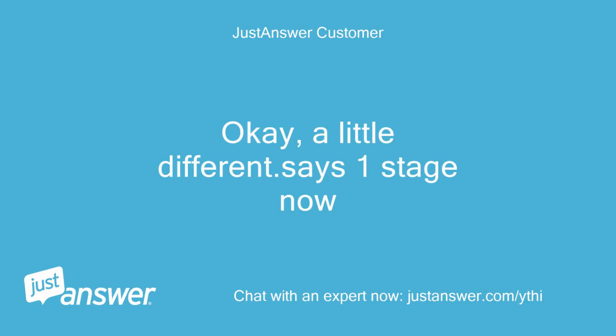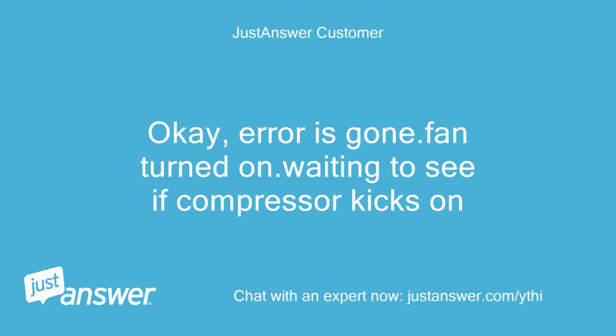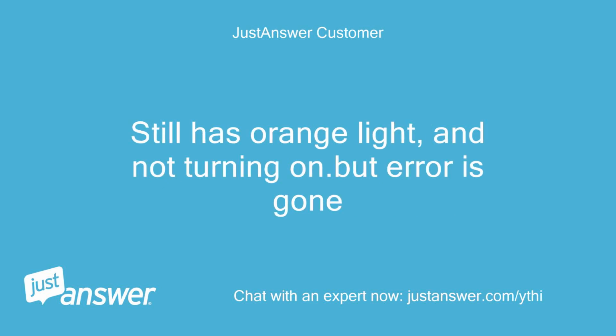Okay, a little different, it says one stage now. Now doing a static pressure check. Okay, error is gone. Fan turned on. Waiting to see if compressor kicks on. Still has orange light, and not turning on. But error is gone.